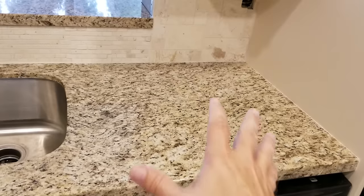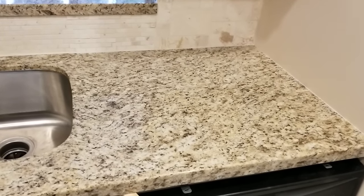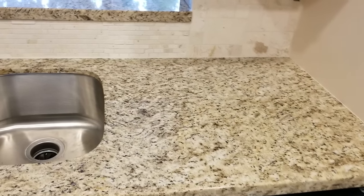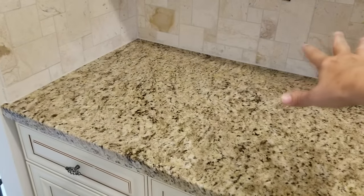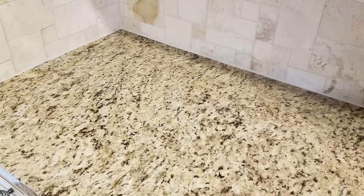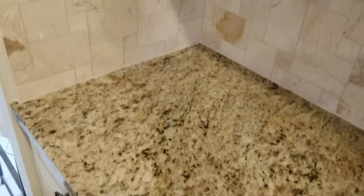You don't see any big harsh shadows like you do with some of the other ones — like the one we saw with all the white cabinets, where you could see how poorly placed the lighting was. Coming over to this other side too, you'll see the same thing on the left side of the stove. We have our light 24 inches in front of the cabinet, and when it shines down with that cone, it lights up the whole area all the way to the back wall. I want every one of you to go and check your counters right now — do you have a dark shadow like the dark side of the moon around there?